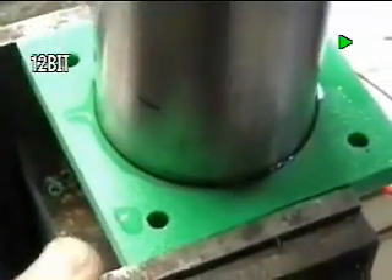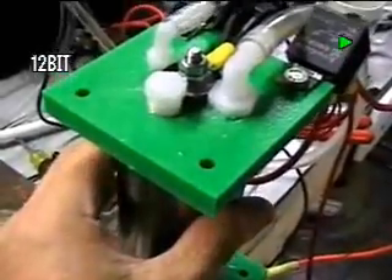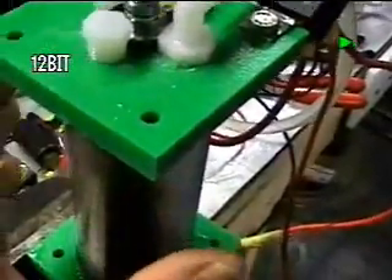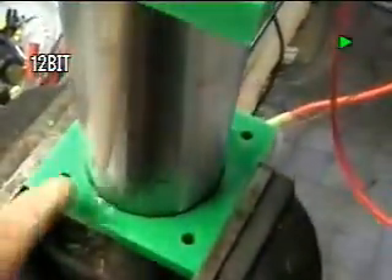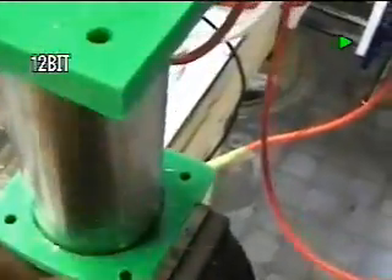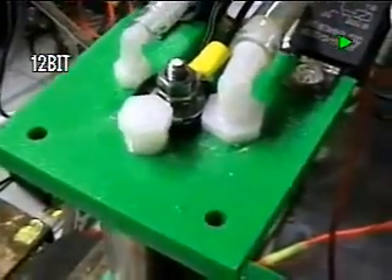But if you'll notice now, on the Series 9B, there are no outside bolts on the outside like the old A-Series. That's not leaking from the unit, believe me. What it is now is you can mount your unit from four places on the bottom and two on the top. And we also have a new optional fan coming in that'll actually fit right here and hang down off the side and blow air across the unit, fitting right off these holes. A small 60mm DC 12-volt fan that'll go right in here and blow air across it to get it a little bit cooler.